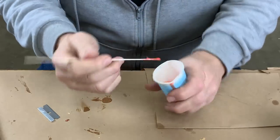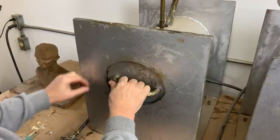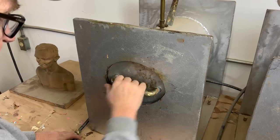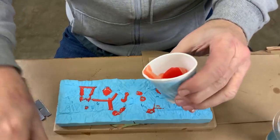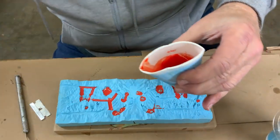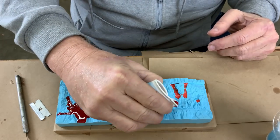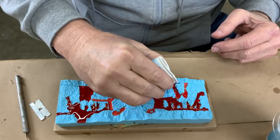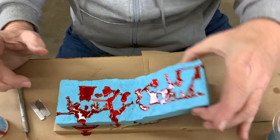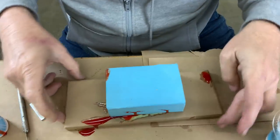Check of the witness cup — yep, hard as a rock. Let's go pull those things out of the pot. Let's mix the resin. Now this time we can be a little sloppier with our pour. We don't want to be super sloppy because we still don't want a lot of flash, but the reality is you're going to have flash around these parts. We are definitely going to get some squeeze-out, some flash — let's do it. Okay, definitely have some squeeze-out, some mess.